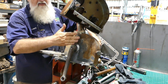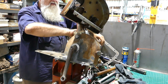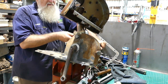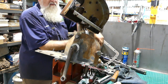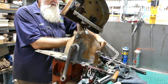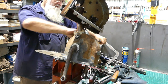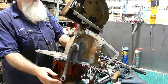What we're doing is bringing that steering sector across into the pinion to get rid of the backlash. I'll just back this nut off a little bit. Take it right up until it stops. Take it off just a millimeter or so. And you can just feel a little movement there.